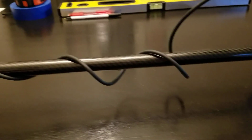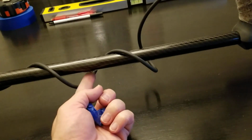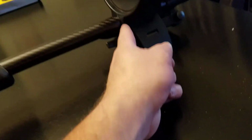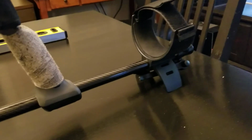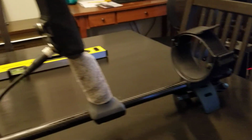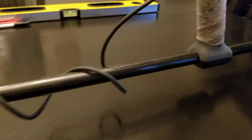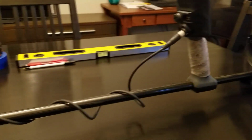So the holes that I used were 15/64 to connect the lower shaft, and then 23/64 for this hole, and I did 3 back here for adjusting the arm cuff. The 23/64 doesn't give you very much room, so I filed it all with a Dremel to smooth the holes out. So yeah, I think it turned out pretty good. It looks awesome. I love carbon fiber. And again, I'll post the links to where I got the material.